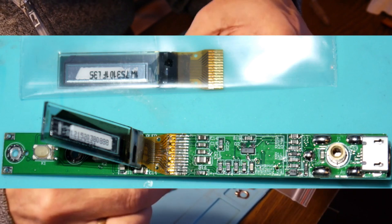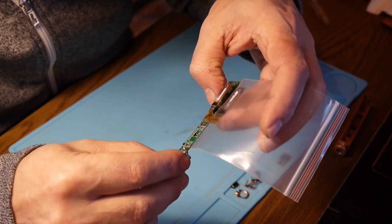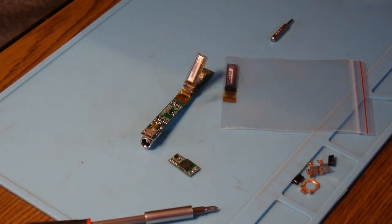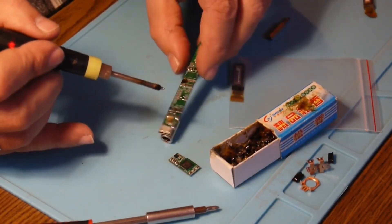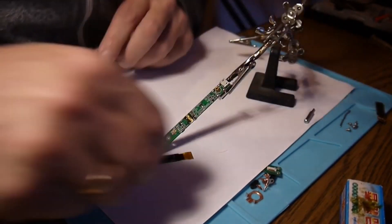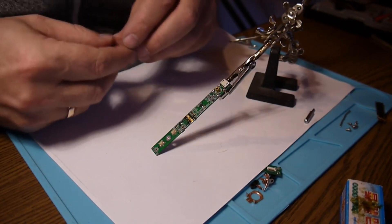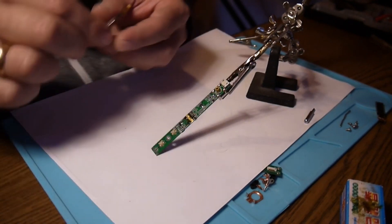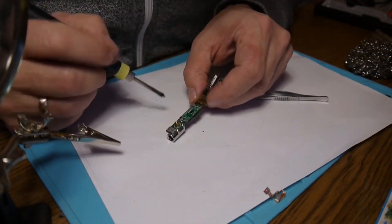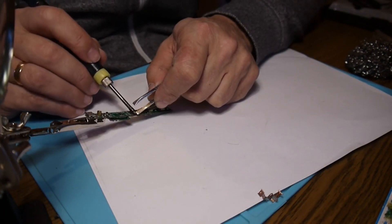Let's see if it's the same — yeah, it's looking the same. The new one looks the same, so let's do the replacement. I'm using the small soldering iron with a lot of flux of course. The old one is out. Prepare the place before putting the new one in. Use low-melt solder if possible and be really careful because too much heat will damage the ribbon. It needs to be pushed down very well while you're making the solder joint.